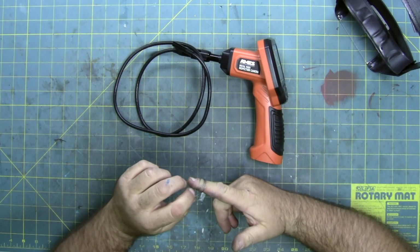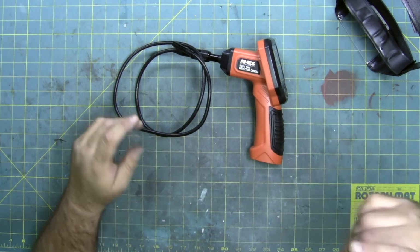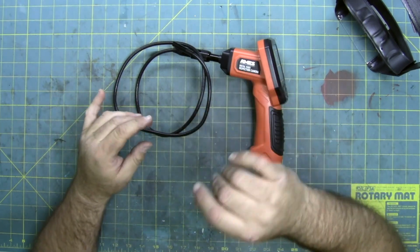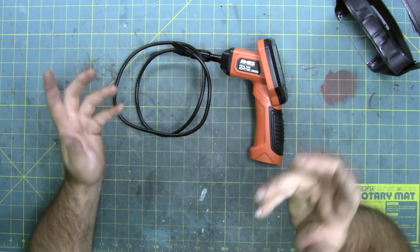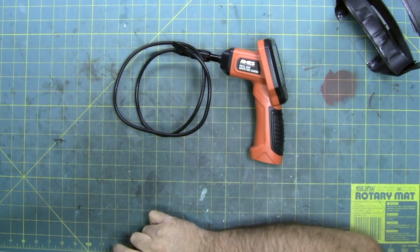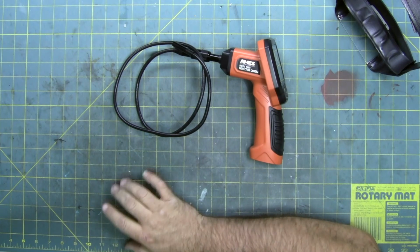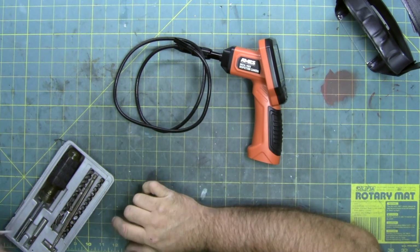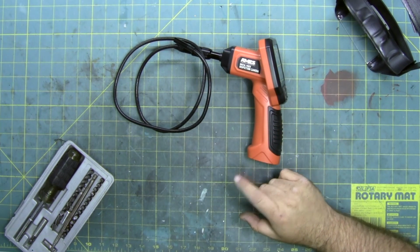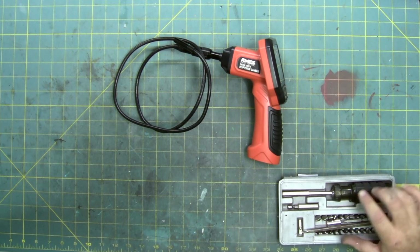I put on 3 coats. I put on 1 coat to hold it, and also fill in the indentation in the plastic base. A 2nd coat to make it more smooth and flat, and a 3rd coat to not only ensure everything's good, but also to insulate the pin. One of the reasons they used hot glue was as an insulator so the 4 pins wouldn't touch each other or touch that metal sleeve, which is usually a ground sleeve, because that would be bad. So, the light works, the camera now works, and hopefully, if anybody out there has to replace a pin on an S-video style cable and it can come apart, this helps with the process, because, yeah, it wasn't easy.